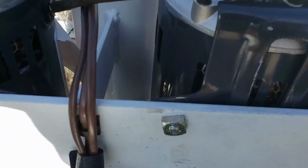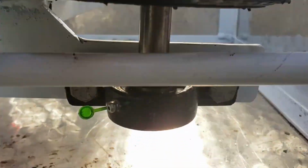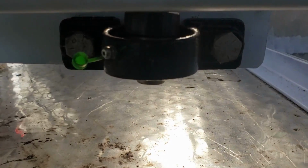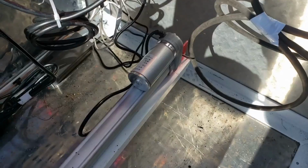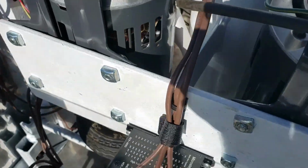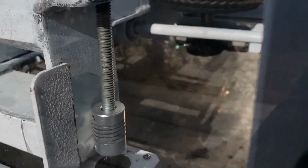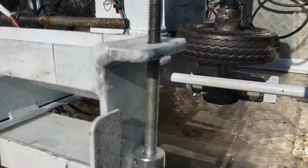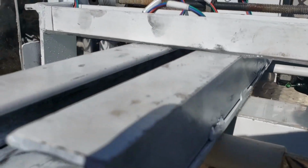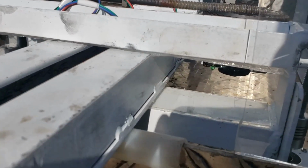These 2 motors right here are connected directly to the wheels, which are mounted onto pillow blocks to allow flexibility in the system. Entire firing pieces, which include the linear actuator, the 2 motors, the wheels, and the tube which fire the pucks, are all mounted onto a single pillow block. And then the tube just slides around in the aiming mechanism.